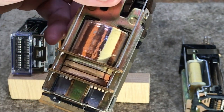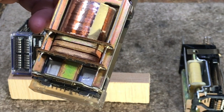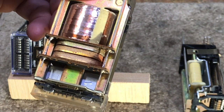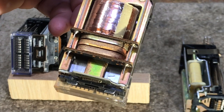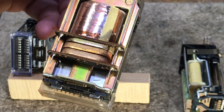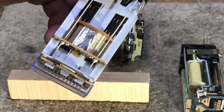However, this one is an AC relay intended to be used in a ringing circuit. It will not chatter during the ringing of the phone because your phone rings on 20 or 30 cycles. With AC current the relay would chatter, but this particular one is designed not to. Once it's operated it will remain operated even though the polarity of the AC is going positive, negative, positive, negative.